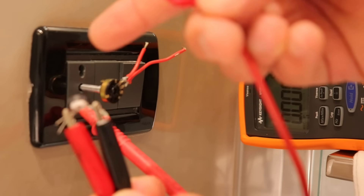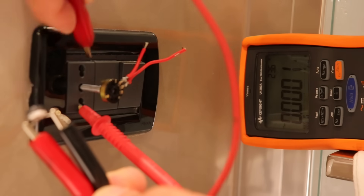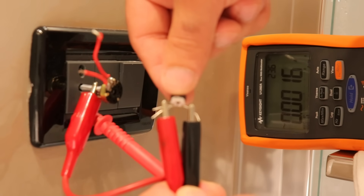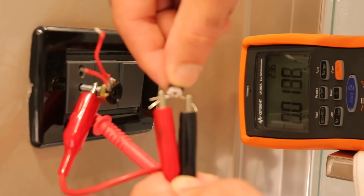As is tradition with the European standard, it seems like the whole apartment is protected by ground fault protection, unlike the North American standard where ground fault protection, if installed, is only in the washroom. Now it did trip at 30 milliamps, but let's check if the tripping current is different. I set my potentiometer to maximum 100k for minimum current, connect it up, and now change the potentiometer gradually — 5 milliamps, 10 milliamps, 20, 25... yes, I think it is 30 milliamps. Now I just reset the breaker. Good thing I found where it is.